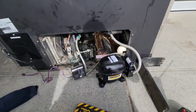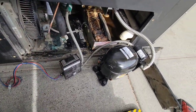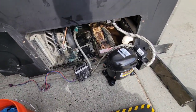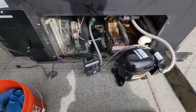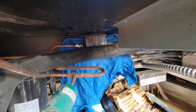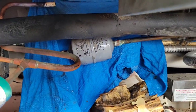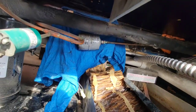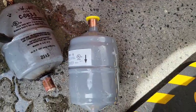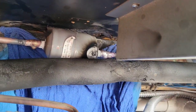I could have put this in the back room to begin with since it was on wheels, or moved it outside to begin with. I couldn't move it on the back deck because they'd lock me out — they're loading a shipment — so I'm on the sidewalk right now. I got my wet rags, I'm going to hang them in there while sweating. I'm going to sweat one side, put in the new filter dryer — just look at the arrows pointing this way. When you order them it's pretty easy: C83S, and this one is a C83S.